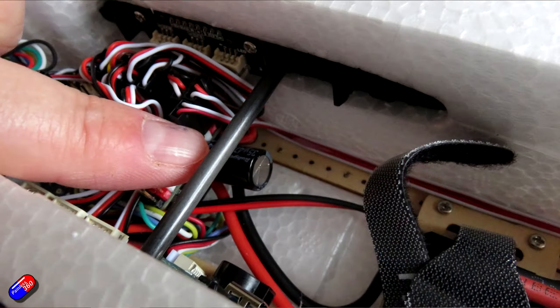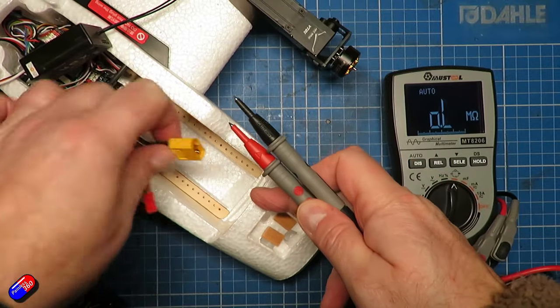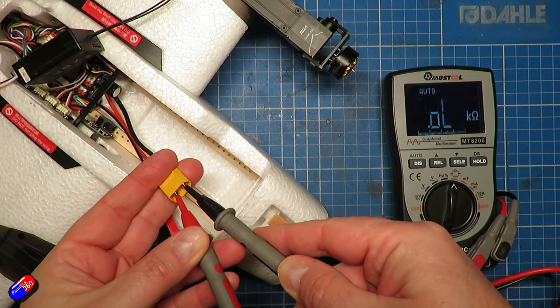Now, a big part of this is that there are lots of things like capacitors inside a circuit. Capacitors look like these little round cans that you see in flight controllers and models all the time. These capacitors store electrical charge and they're completely empty when you first plug the power in. When you first plug the power, the electricity runs through the circuit and charges the inside of the capacitor up. Once that capacitor is charged up, the current stops flowing. You can actually see this when you check the power leads on a model using an ohmmeter. When you first connect the leads, the number is very low — a low resistance, i.e. a dead short — but then very quickly you'll see the resistance rise. That's because the minute current the ohmmeter uses to measure resistance actually charges those capacitors, and it takes a little bit longer because the current is incredibly low, as opposed to when you slam 12, 16 or more volts in there. That's that little spark.